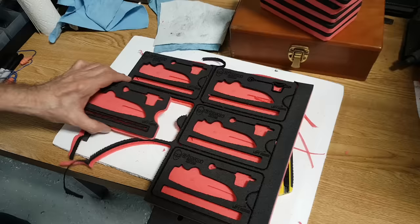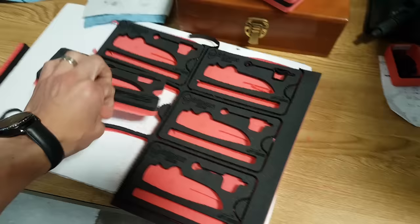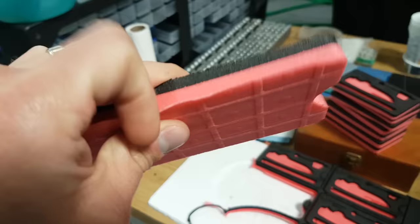We make them six at a time in the sheet, and the next step is to break them off. They're all going to have flappy bits because since it's being vacuumed down you can actually see the grid pattern. You can't break through or else you lose vacuum and the whole thing flies off, so we left 50 thou on the bottom. Then we have to go over to the little grinder — Barry's going to show us how he does that.